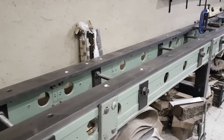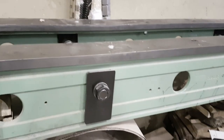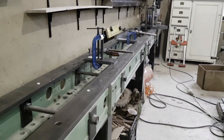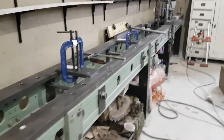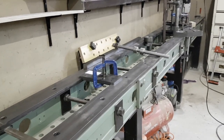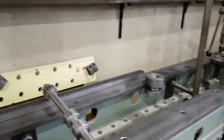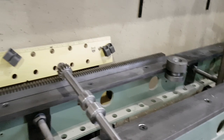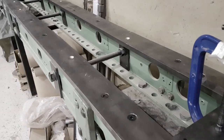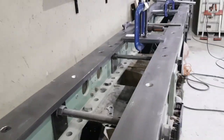I think the number of parts could be between 500 and 1000. Many of them need to be cut on a laser — like every plate here — and a lot still needs other work like work on a lathe, welding, sanding properly and very finely. The whole project started about three years ago with drawings in CAD to make everything work geometry-wise, because sometimes you imagine things in your head that don't correspond to real life — you put pieces in the same spot and realize there are five bolts in the way of the carriage passing through.